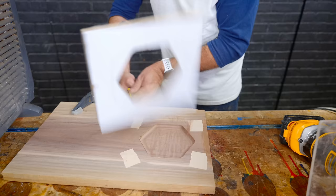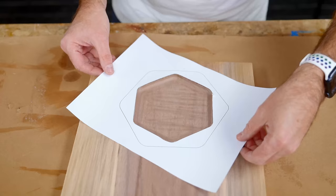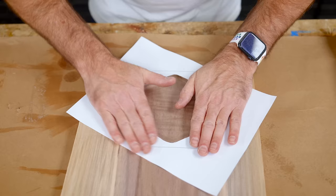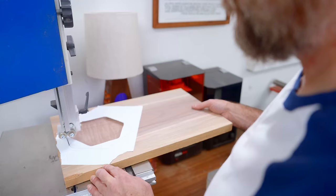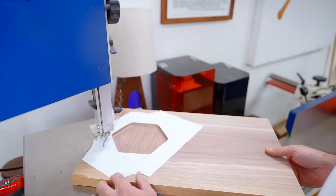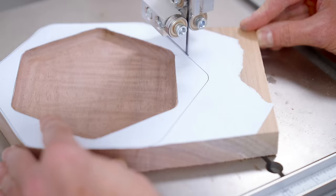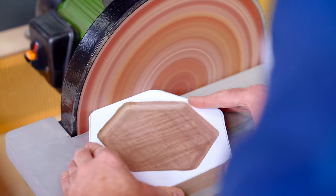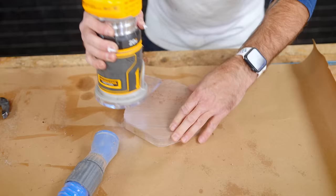And there we go. Now we can cut out the outside shape. I printed out another template that I'm going to use some spray adhesive and attach it to my wood so I can get my outside line. Then we can cut this out either with a jigsaw or a bandsaw. I always like to cut as close to the line as I can without touching it and then sanding down to the lines. Now we're going to add a little decorative round over to the bottom, do some finish sanding and move on to the next project.